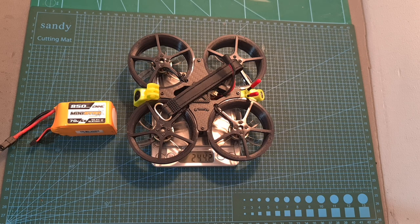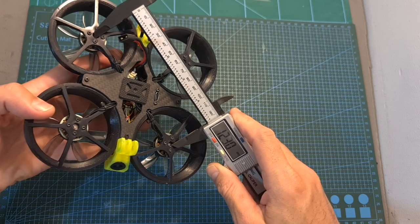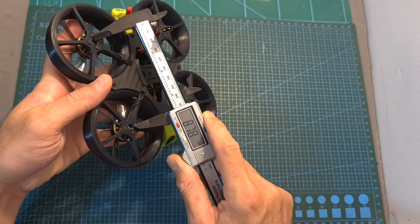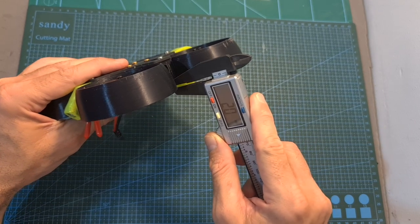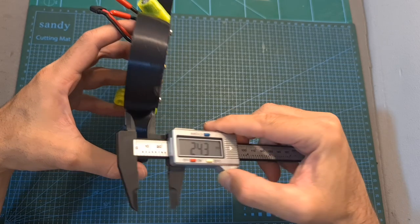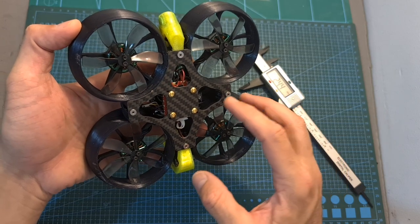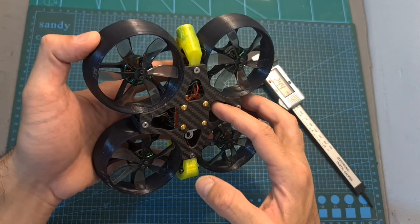As for its weight, due to the massive ducts, the Racewhoop25 is not a light quadcopter. Without a battery, it weighs 244.2 grams and including a 6S 850mAh battery, which, according to my experience, works best with this setup, the total weight is about 396 grams. In addition, the wheelbase of the frame is 123mm and it features a true X pattern. The thickness of the bottom and top plates is 2mm. The distance between them is 24.3mm, and that's the reason the digital versions of both Racewhoop25 and Racewhoop30 are using the Zeus 35 all-in-1 flight controller, as the Vista unit is mounted on top of it.